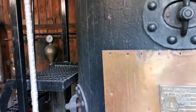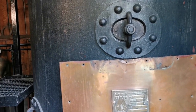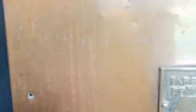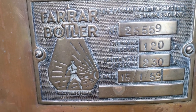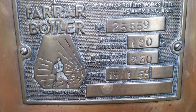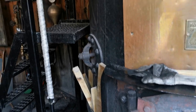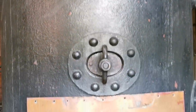The heat of the fire will melt the plug, then what water remains will run through and douse the fire. At absolute worst it at least dumps the excess steam pressure — it'll just blow off through the plug that's then gone. So if I just show you the plate there — this boiler isn't Victorian. Obviously the majority of Victorian boilers of this style are no longer serviceable. This one was built in 1959, so it is old, and it was one of the last of these cast iron riveted type boilers before they moved over to steel, which were more efficient and easier to produce.